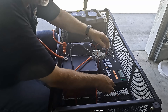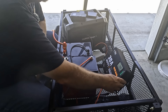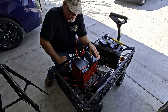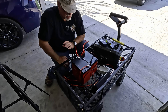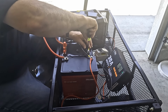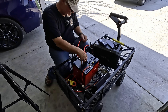Now when I look at this guy right here it shows me that I have a battery — it thinks it's 12 volts still. There we go. So what I had to do when I hooked this up, because it was set up as 12 volts before, I had to go into the settings and change it to 24 volts. So everything there is set up. Now all we have to do is connect this up to the power station. We've got 26.7 volts, so we now have a charge controller set up on 24 volts and two 12-volt batteries in series.